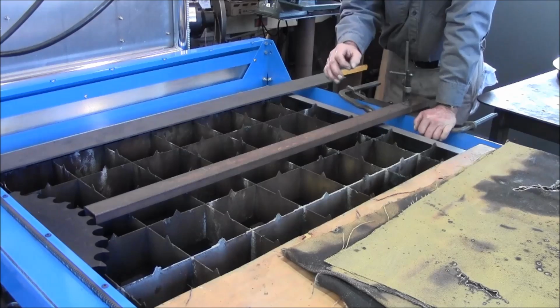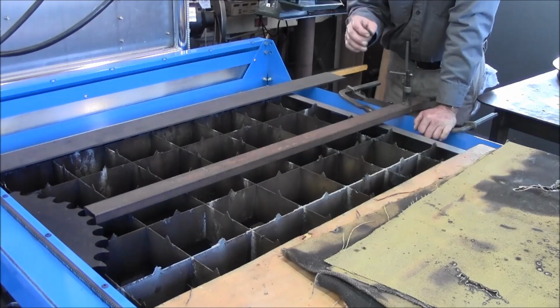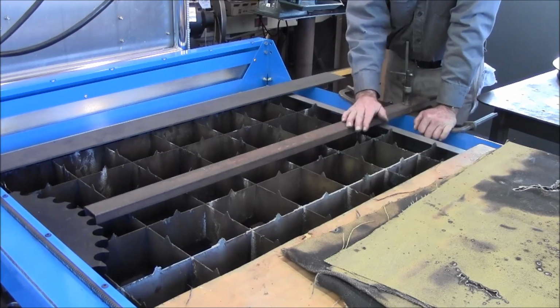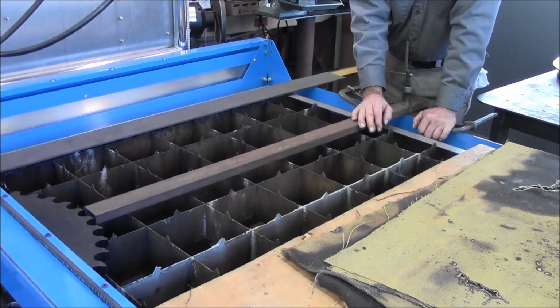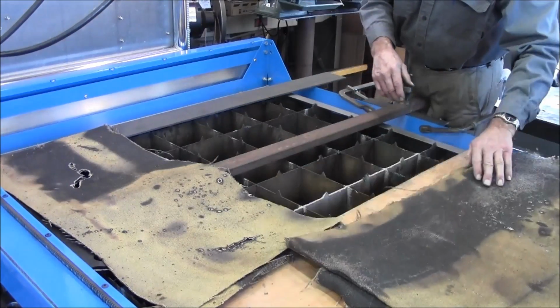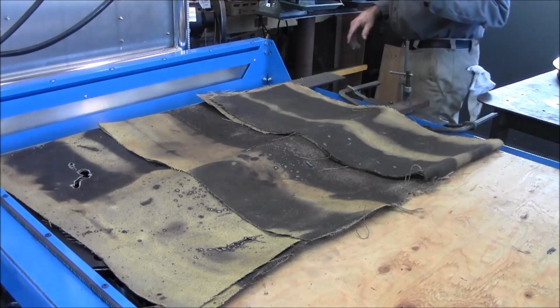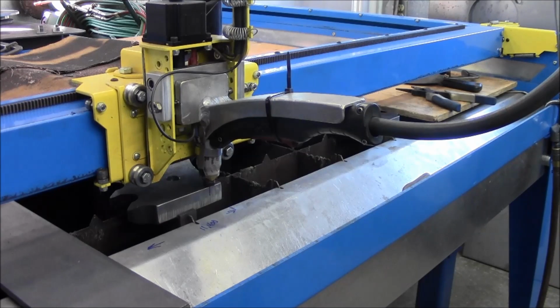It was 5 inches a minute, and I just calculated that we're going to be 4 minutes and 44 seconds for this cut. That's going to be an awful lot of heat, and the thing's going to really want to be moving around. So by putting some inward pressure here against the stops down there, we're going to minimize the amount of moving around. Okay, so now we're throwing our covers back on here so that we keep the draft secure. It works real good, but we keep it down to a minimum. Boy, I feel like a drum roll right now. There we go.